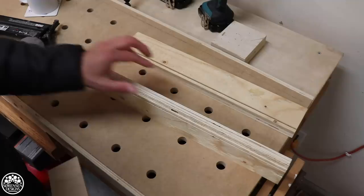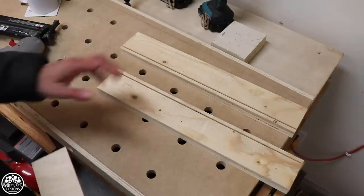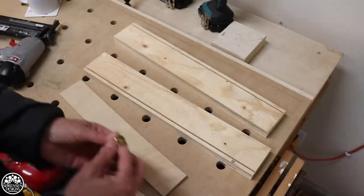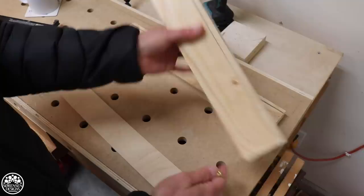You could definitely just use a 3/4 inch piece of plywood. You might even get away with a 1/2 inch. You'll notice I cut a slot on the table saw on either side. So on both halves, they'll be facing each other. You want to make sure that you do 2 passes, especially if you have a thinner blade like I have.